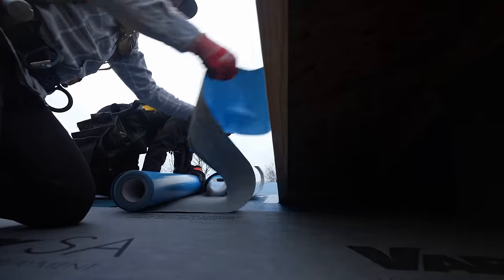One of my favorite parts about this product is for things like this — look at how nice this worked out in the 90-degree corners, flashing up a wall, just beautifully. We'll run with it. When it's pressure sensitive and you step on it, it actually adheres more versus felt paper — if you step on felt paper after it's tacked down you want to step on the laps, otherwise you could potentially rip it and roll it, breaking it going down the roof. With this product, the more you step on it, the more it's adhered.